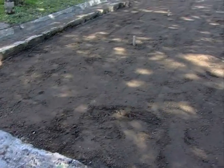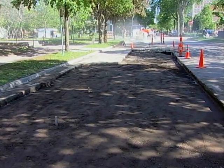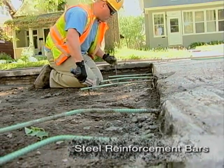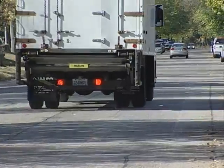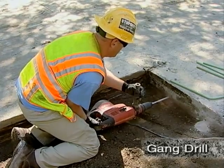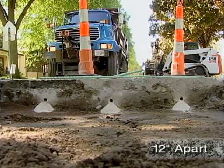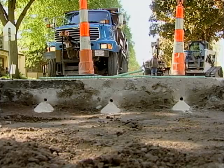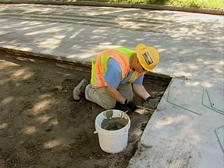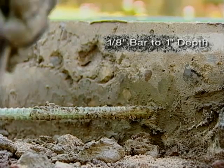Once the damaged roadway is removed, replacing it is very similar to creating a new concrete roadway, with some important exceptions. One of those is the installation of steel reinforcement bars in the remaining concrete road — when the roadway is replaced, the bars will help distribute the weight of vehicles from one concrete panel to the next. Use a gang drill, or a drill that can make holes horizontally, to drill into the adjacent concrete pavement panels. The bars are usually spaced about 12 inches apart, but you can locate them so they'll be under the wheel path of vehicles. There is less of a need to place the bars in roadway used for parking.